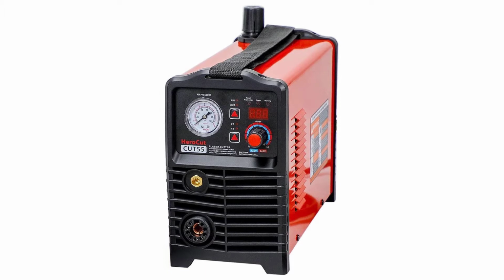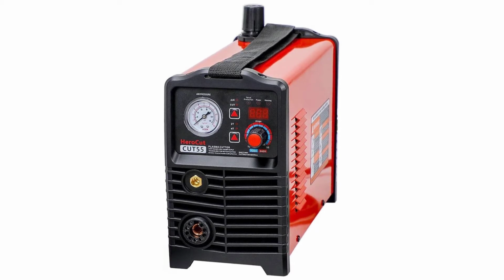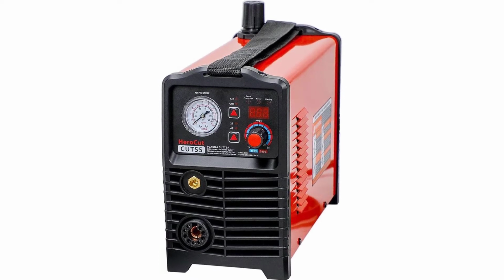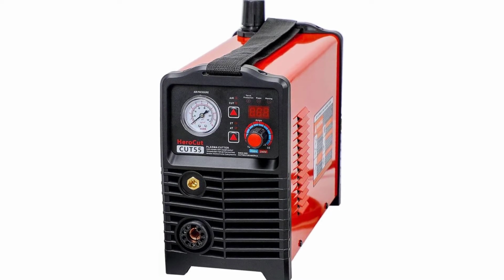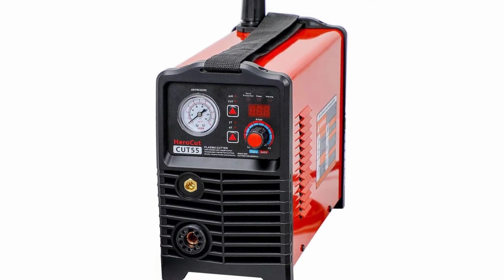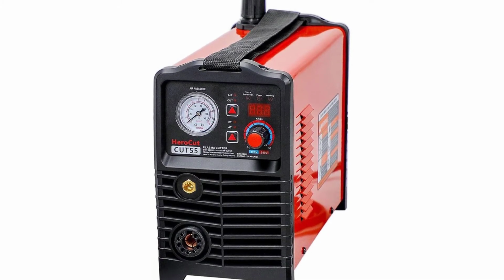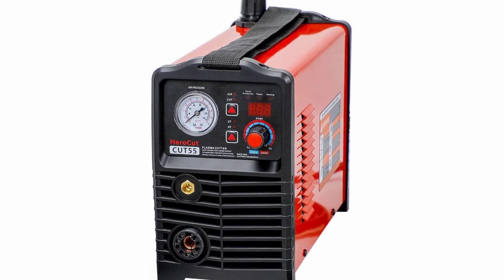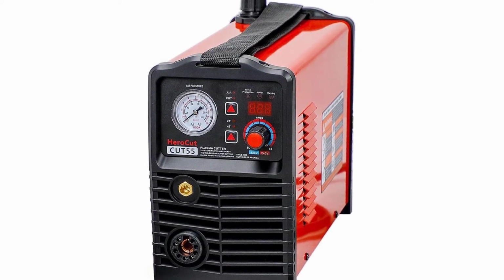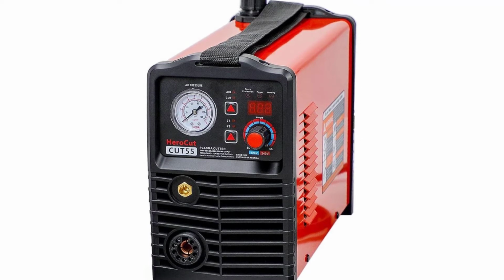CNC plasma cutter, HEROCUT 55i, dual voltage 120-240V, non-HF blowback pilot arc. Lightweight but powerful, CUT 55i can easily clean cut 16mm, max severance 25mm metal with 65 psi under 220V in a short time if needed. It is an excellent choice for home jobs and light-duty small business projects.